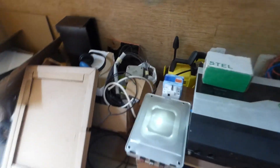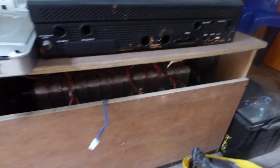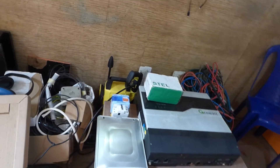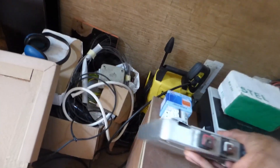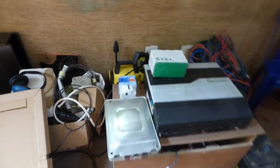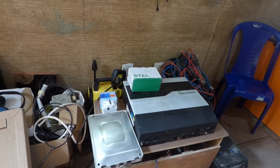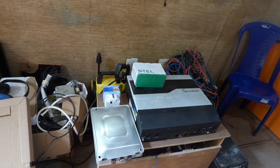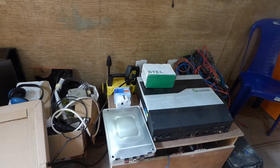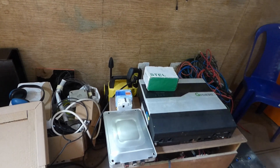Here is a Nissan Leaf cell. If you look in there, my Nissan Leaf battery is in there. This was cheap — actually it looks a bit damaged because it's swollen, so this is definitely damaged. When it swells like that it's damaged. The advantages of the Nissan Leaf: price per kilowatt hour is very competitive — I think it's the cheapest of everything I've purchased. You can do them in multiple configurations: 12, 24, 48 volts or even a little higher.